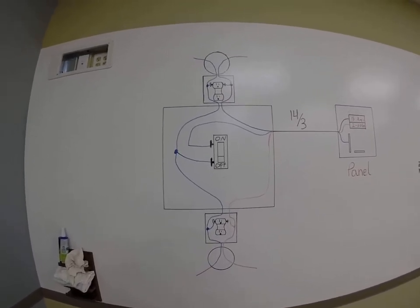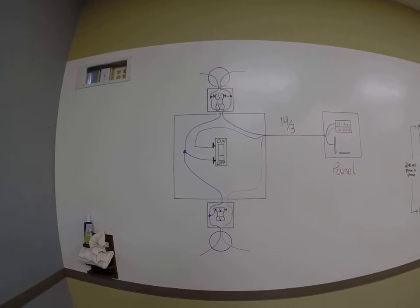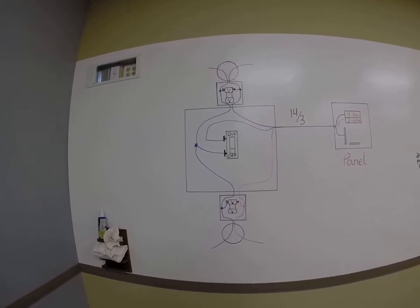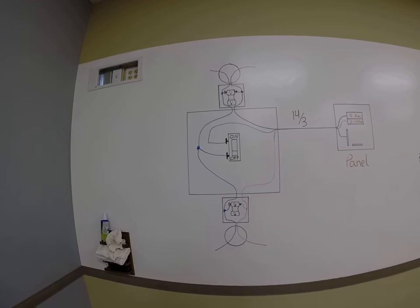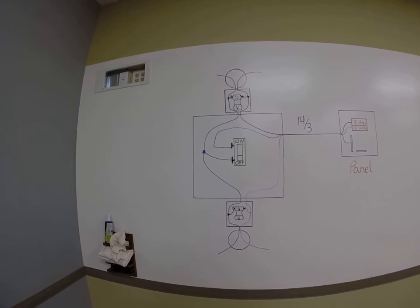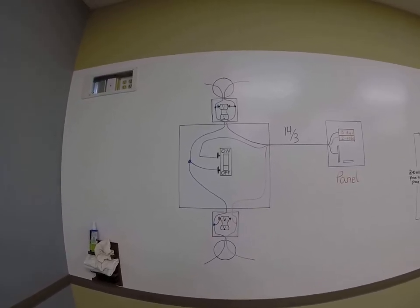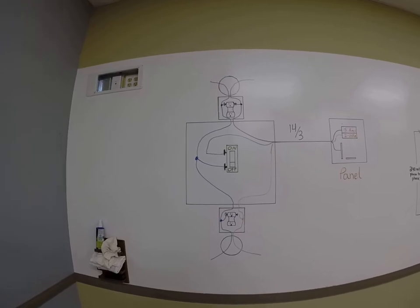So when we see the next video, the hard wiring in my lab looks like this picture. I blew up the single pole switch so that you can clearly see that the whites are tied onto the switch. We would never do this, but I'm doing it so that I can safely open the neutral under load. I need to open the neutral under load so I can demonstrate that we're going from a parallel circuit to a series circuit and what actually happens. There's a pretty good mathematical computation by Mike Holt in Article 210, multi-wire branch circuits, but I'm simplifying so you can visually see what happens. We'll get back to this picture in a later video.